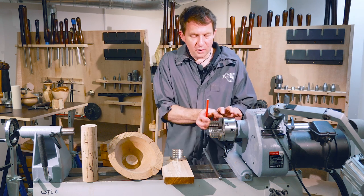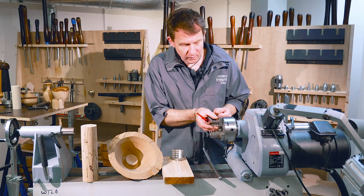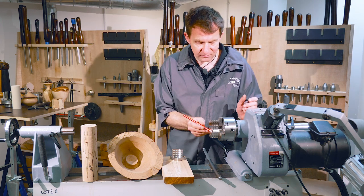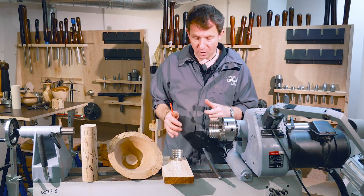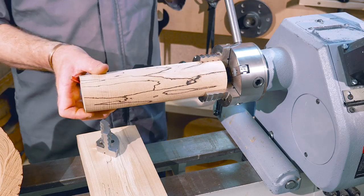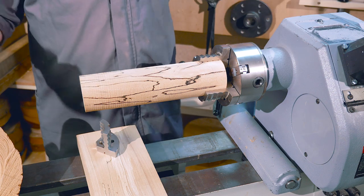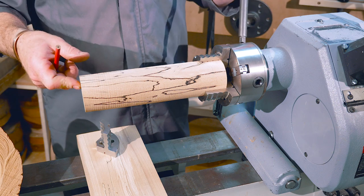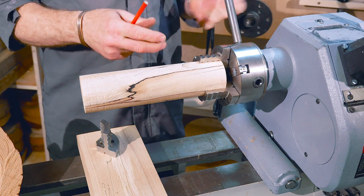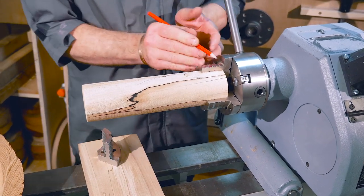Another set of jaws that draw your hand away from the chuck is the Piranhas. The longer length makes them safer to use. We've got a lovely serrated tooth down here that provides lots of grip, be it externally or internally. We have a dovetail top and bottom so you can do it in the bottom of a bowl. One thing I really use these for is drilling my salt and pepper mills — you can put these in, close it right down. With the length of the body material, lots of grip — very stable. So with the lathe running, you can draw your hole all the way down through. You come to about halfway and then I find it easier to turn it around and draw the other end. This allows us to centre it quickly, very versatile, and extremely safe for holding those longer lengths due to that extended length.